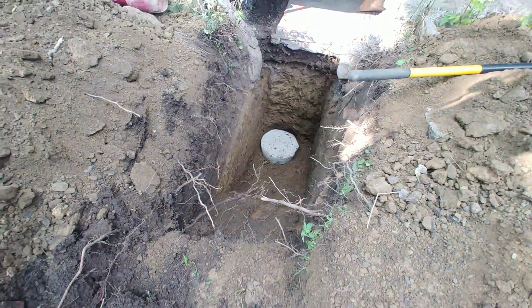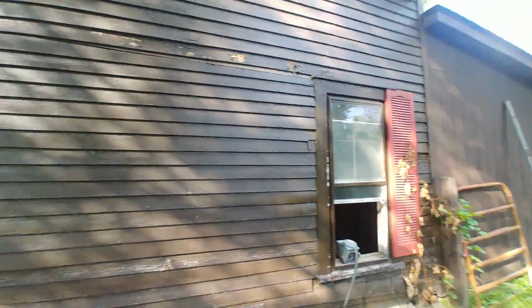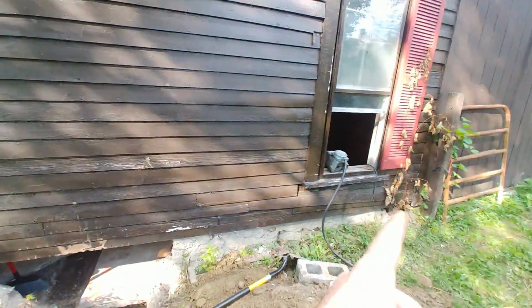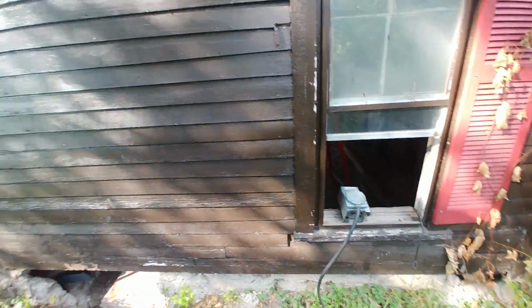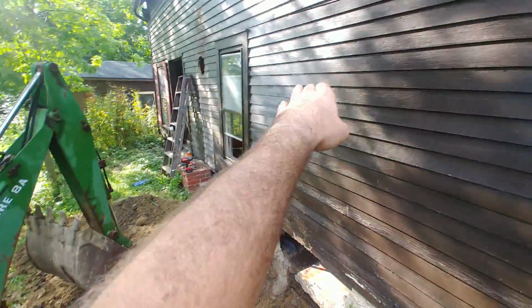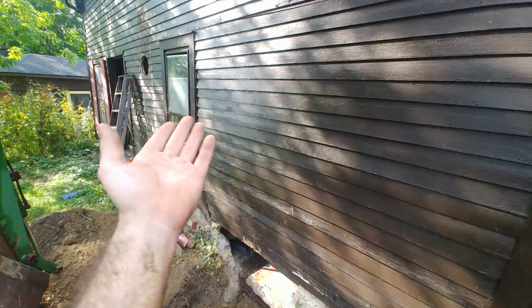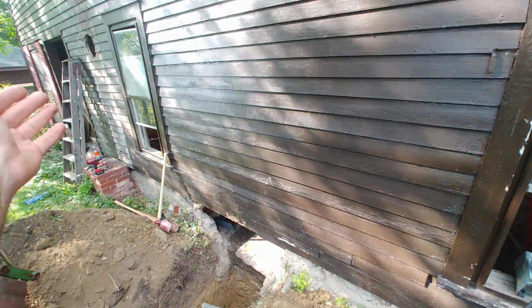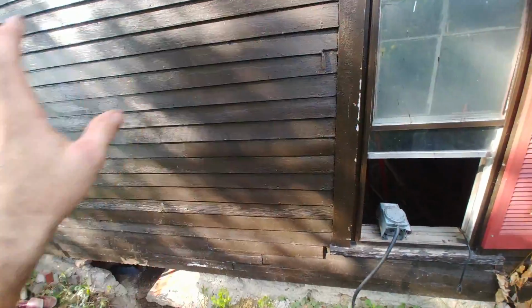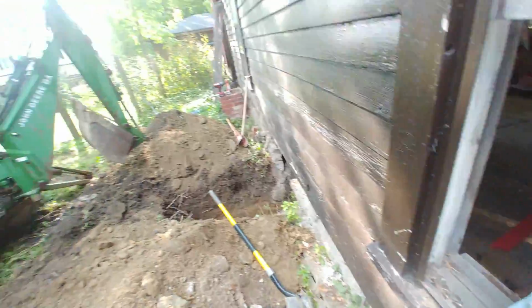Okay, this is footer number 1. A lot of different reasons we picked this location. I'll show you. It's not the corner, it's the first from the corner outside. You've got all kinds of variables. You got the end foundation pseudo holding up the ends of the building, even though they are caving off. So we are just trying to hold up this side and a little bit down both sides with the lifting arrangement inside, or in there.